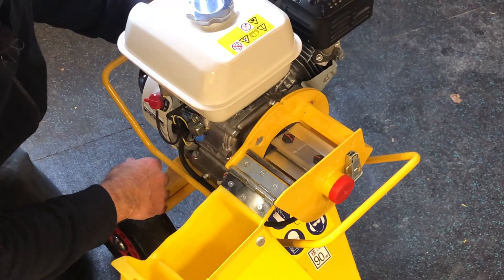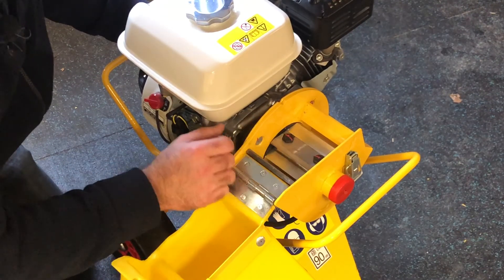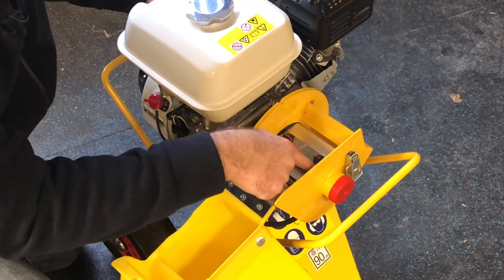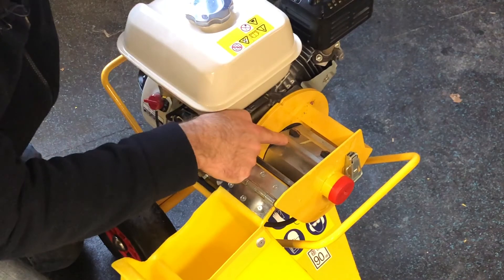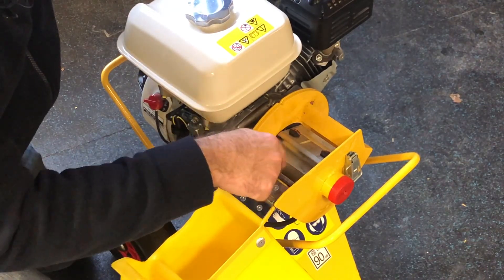The M100 has a 100 millimetre wide cutting drum. Much the same as its big brothers, it is fitted with two knives, but on this one the knife only has one cutting edge. We have one knife mounted here and then 180 degrees round is the next knife. This knife cuts up against the anvil blade, which is also adjustable.